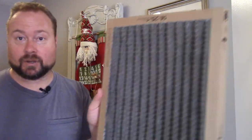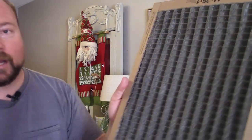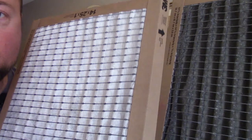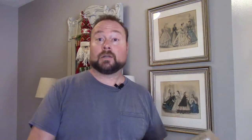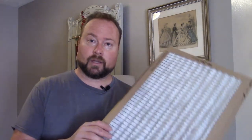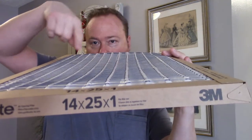So that first part was super easy. Let me show you this — it's a little overdue. This is what I just pulled out. Now it's not caked with hair and dust bunnies, but that's what a new one looks like, and there is a good coating of dust on this — it's time to get rid of it. This is a basic paper pleated air filter. It's pleated because it has ridges, which gives it more surface area, allows air to come through easier, and allows it to collect more dust before it's clogged. It lasts longer than a flat fiberglass filter.